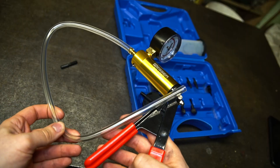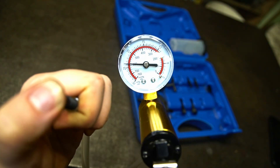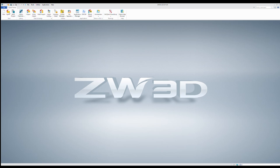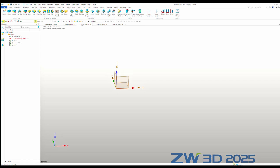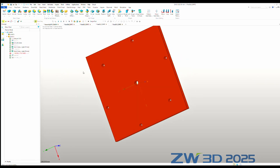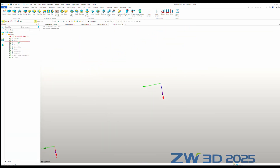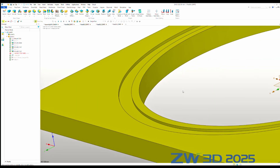This pump generates vacuum so it should be able to bleed air out of epoxy. Using ZW3D CAD I made a quick design of the vacuum chamber. I extruded a box and made a 1 mm thick shell which will be made out of steel. The next part is an o-ring with a 121 mm inside diameter which will be 3D printed out of TPU. Later on is the cover out of plexiglass with six 5 mm holes. And the last one is the flange of the steel box which will be used for bolting down the cover on the top.